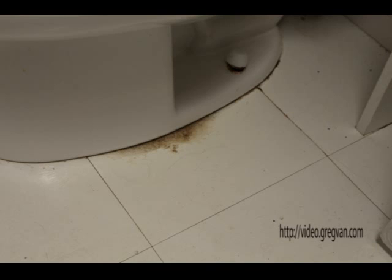You're going to see a spot where the water is leaking or could leak from. If that's the case, put another wax ring on it and put the toilet back to see if the water leak goes away. You can always double up the wax rings if you think that's the problem — these are usually inexpensive, under five dollars each. Set them in place, set the toilet on top, make sure it's securely fastened.